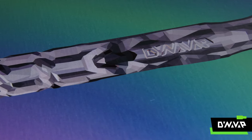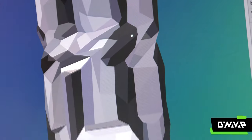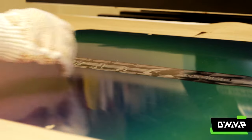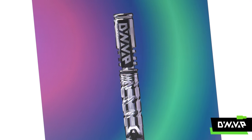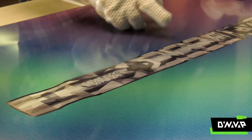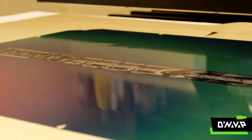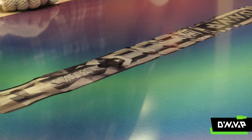The cool thing about sublimation is that any white in your picture is just void — there's no such thing as white sublimation ink. So anything in your drawing that would have been white is now just raw aluminum. You can see some of the grain in there. But as soon as you tint or shade it even a little bit, the sublimation printer will apply some ink. It's really cool how the metal comes through the ink — it's unique to see something that is metal in real life, printed on metal, with the purpose of trying to look like metal.